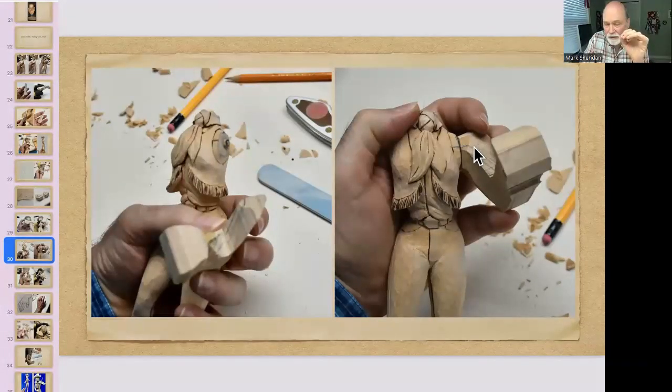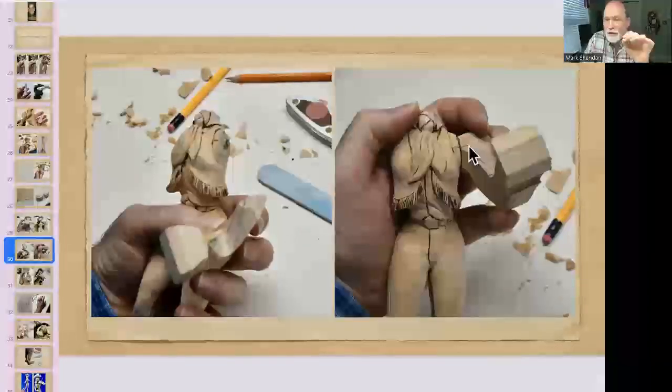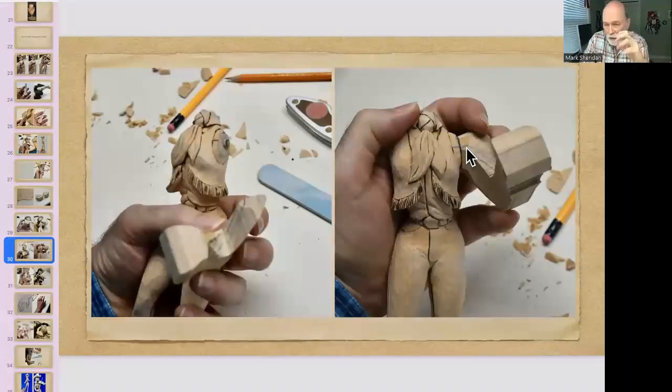I took a gouge and just took those high points off, nothing more than those high points, put it back on the dowel, wiggled it again, took it off. There were new high points showing up on the graphite, took that graphite away. Probably did that 4 or 5 or 6 times until that line was reduced to 0. And then I knew that when I go about gluing at that point, that's going to be an airtight seam there.